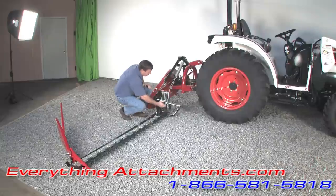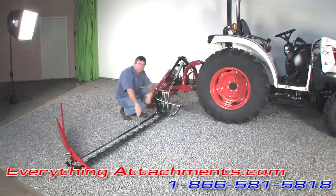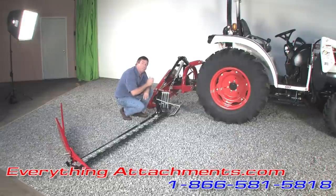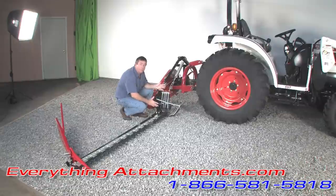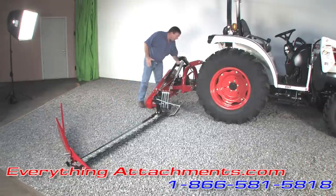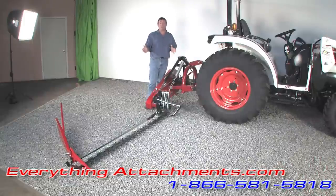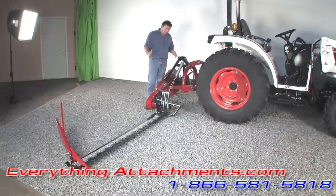This uses basically the same thing externally. It has a cam in the back with control arms, and when you turn that, these go back and forth — that's what controls your sickle. It's a simpler, much less expensive way to maintain what's normally called the wobble box on a New Holland. It's also got a really nice mechanism so if you hit something large like a pole or a fence, it'll spring back.